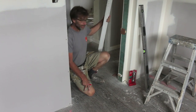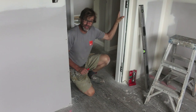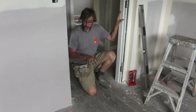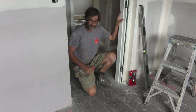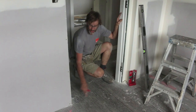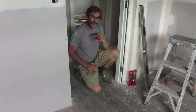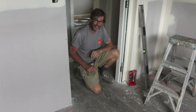With this doorway, the jambs will be sitting hard down on the timber floor, so they both need to be exactly the right length. The problem is that with an old floor, or even a new floor sometimes, the opening might not be level. There might be a few millimetres difference from one side of the floor to the other. So if you cut both jambs exactly the same length, more often than not, by the time a jamb goes down hard on the ground, the top isn't going to be level.